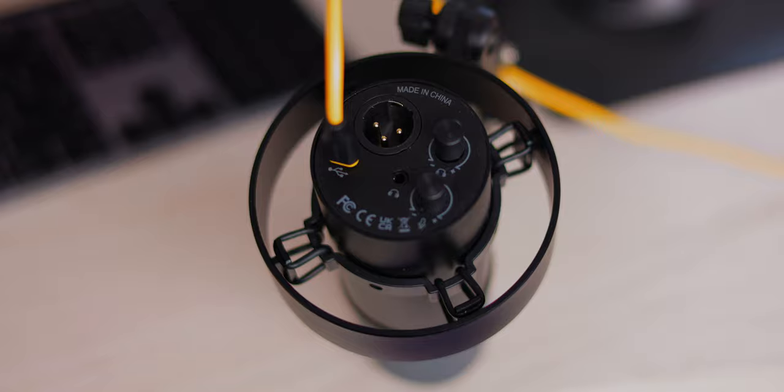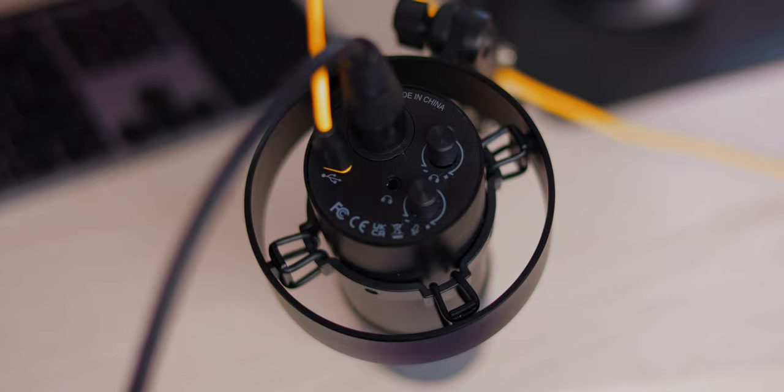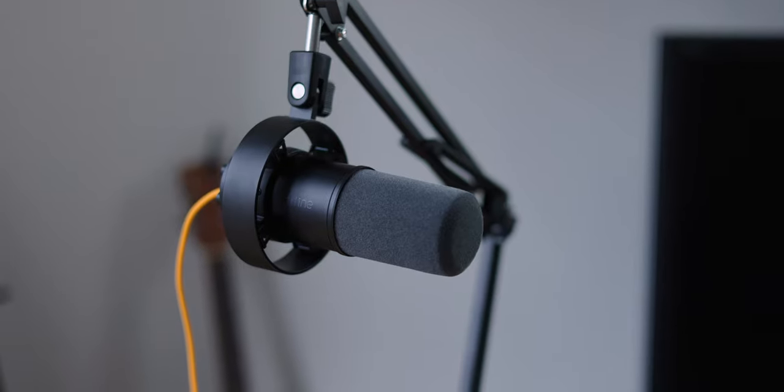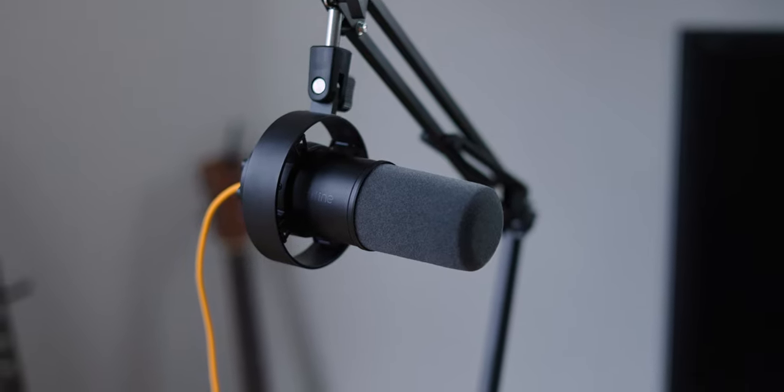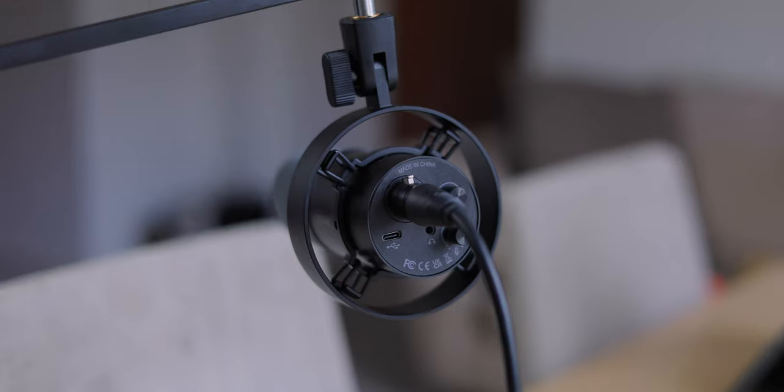This microphone is really user-friendly — you don't need any interfaces for using just the XLR, or you can completely use it via USB-C. I did mention earlier that USB-C in my opinion was just not quite as good quality as XLR, but a lot of people probably won't notice. A benefit of having USB-C built in is pass-through technology, which basically means when this microphone is connected to your computer, you're able to hear all your computer audio as well as monitoring the microphone input directly through headphones.